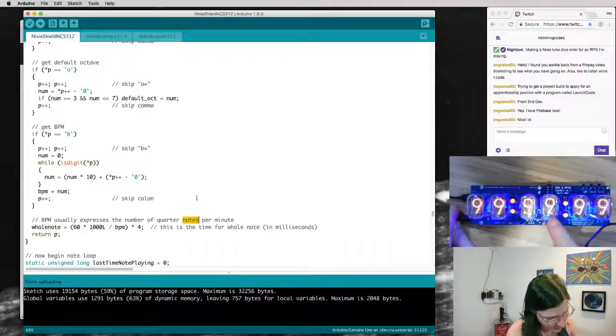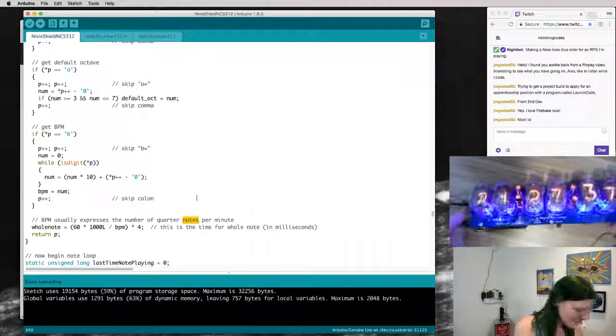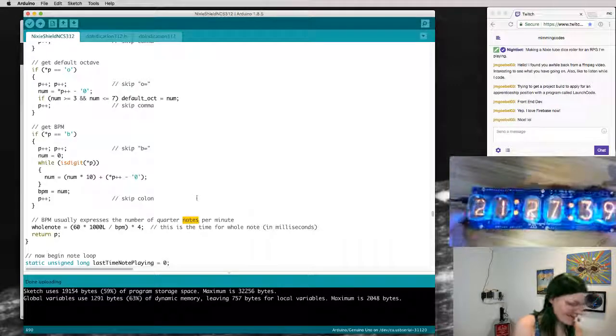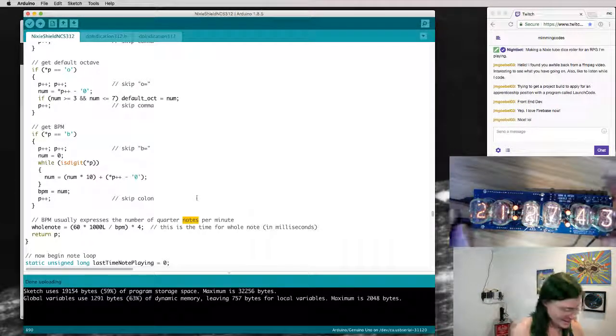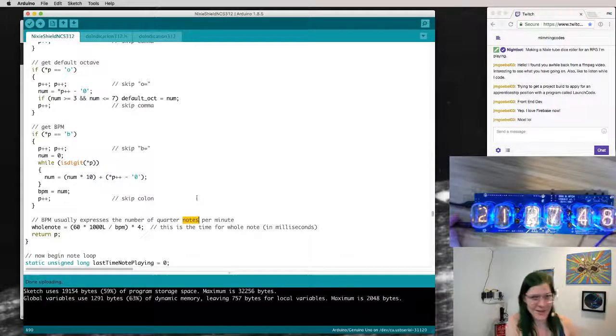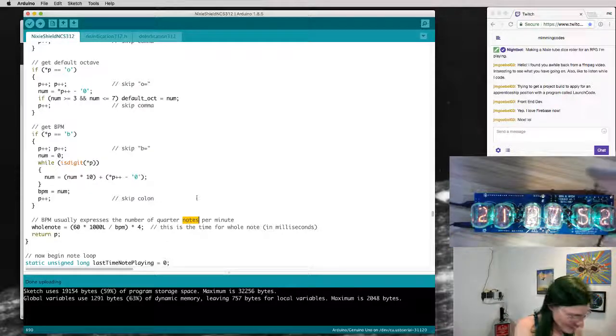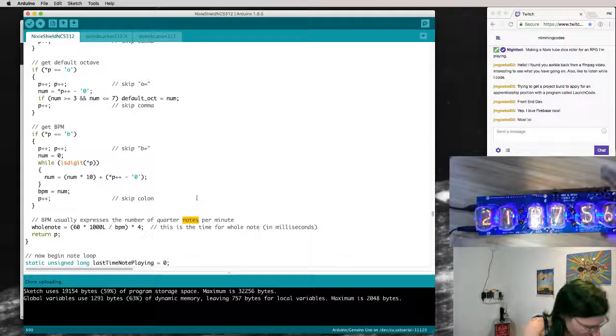This one is just a little bit fussy sometimes, just with number 3. And what's really weird is when it's being fussy, sometimes you can look into the side and see it arcing inside, which is probably not a great thing. So I don't imagine that tube's going to last very long. Usually when you see arcs inside anything, it's a bad sign, but I don't know. These are the first vacuum tubes I've ever owned, so I don't know how forgiving it is to random arcs happening in there.